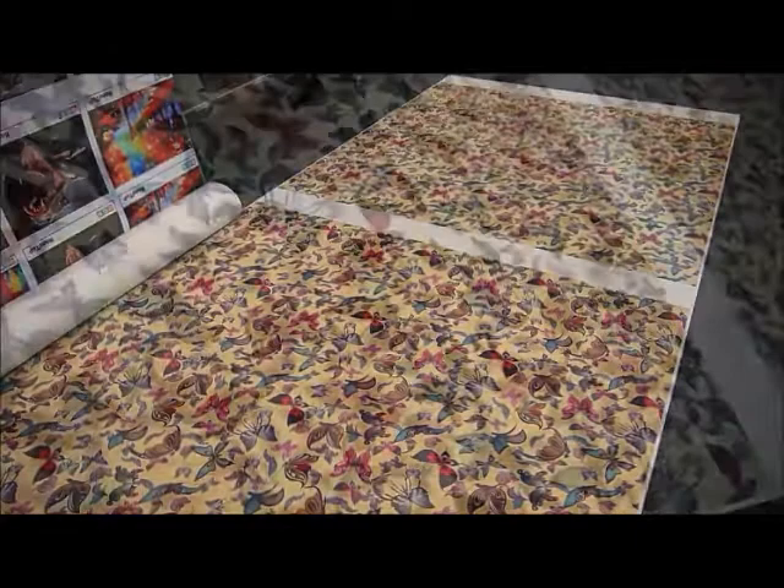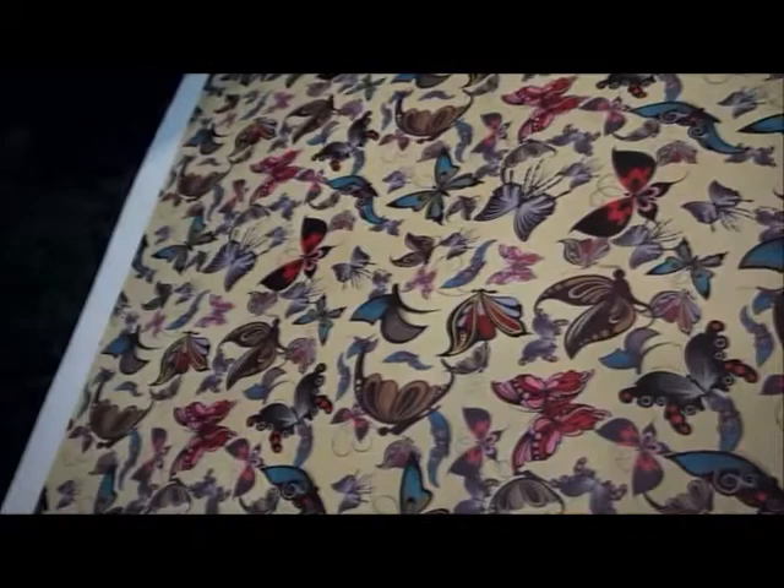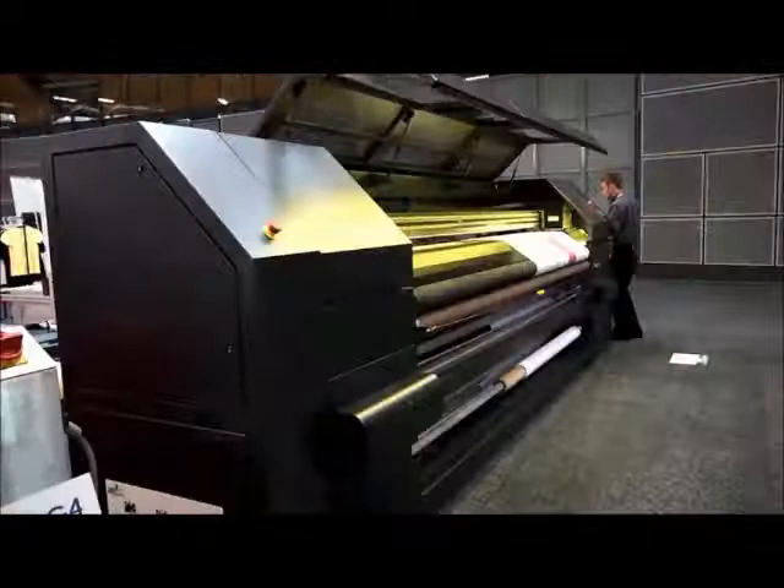Is it a UV printer? Yes, this is UV. At the moment it's metal halide technology, but it can also be adapted to LED. And we're actually standing on a piece of wallpaper here that was printed on it — with wallpaper there needs to be durability against kids, coffee, and everything. The key thing with this is it's no VOC. You don't need a special extractor to use this — we're standing here and can't smell anything. So it's UV, not solvent.